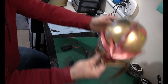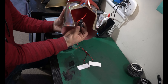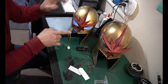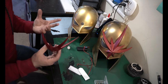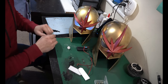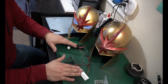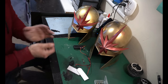This is the entire circuit inside this helmet. All I did was mount it to the battery pack itself — I shortened the wires, glued it to the battery pack, and there's some Velcro holding it up into the top. When I put the helmet on, the eyes turn on. Thank you to Mysterio3D for giving me the idea for the reed switch with the star — he was working with a different system using contacts, and I decided to add the reed switch. It's a really great little project to get your feet wet on printing a helmet, sanding, slicing, and very simple electronic circuits. You can just get these LED eyes, have an on/off switch, or get creative with magnets, reed switches, and trigger switches and just have a little bit of fun with it.